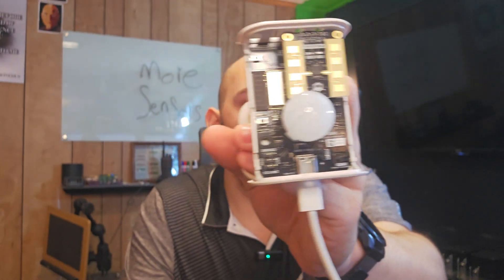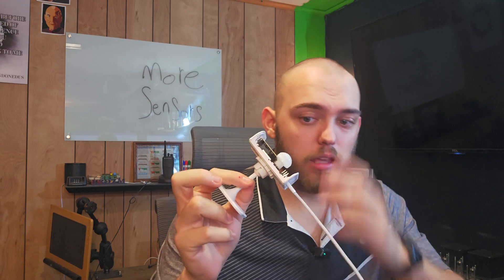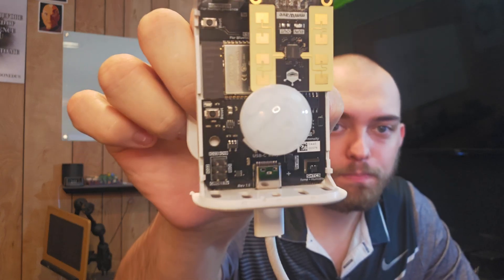In case you guys are curious, while this is flashing, this is what the inside of this looks like. I took the cover off because one of the questions was asking me if the sensor was a 5-pin or a 6-pin. It is, in fact, a 5-pin — at least this one is. Just like the Everything Presence Lite, if you want, you can also get a CO2 sensor that you can pop on these little GPIO pins on the board. Not only will this become a good automation device, but it could potentially become a safety device. I do not have the CO2 sensors and I'm probably not going to buy them, but it's an option if you'd like it.